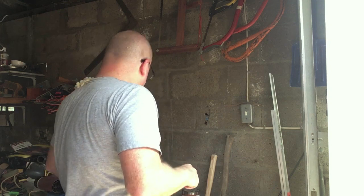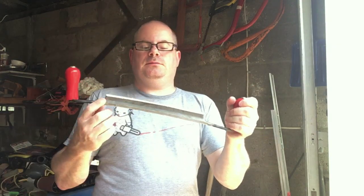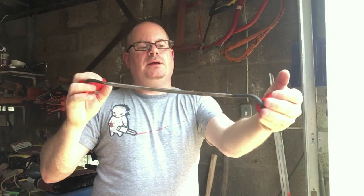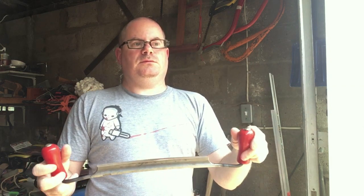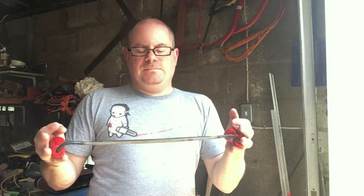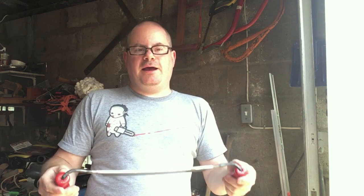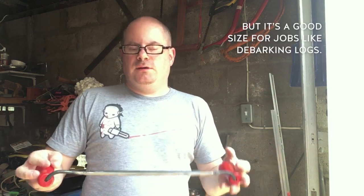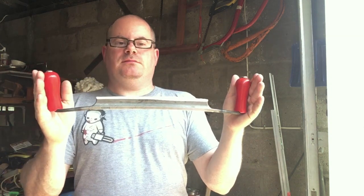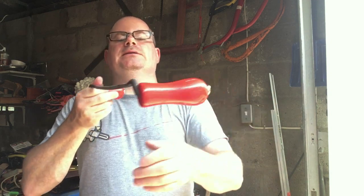My other one, also from Lee Valley, is this Austrian forged draw knife. It's a nine-and-a-half inch blade, it's got the fuller Liam was talking about, and it definitely has a curve to it, which is nice. Now I'm looking at this more critically — it's a good, serviceable knife, not high-end, but I've felt that maybe it's a little too wide for me. It's definitely about an inch and a half more than that eight-inch sweet spot Liam mentioned, and that's actually a lot when you're talking about numbers between eight and ten inches.